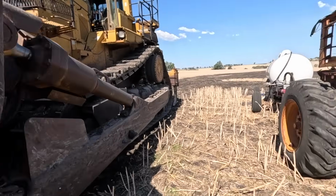So if you can't get the temperature down enough, or if the pressure is too high on your high side, then it struggles to liquefy the gas and it just doesn't work very well at all. So that's basically what's happened there. Hopefully we can get that sorted. I'm not sure where the leak is. I'll probably at some point put a dye shot in it, so we can help find the leak and go from there. But at the minute, we're off to the dozer to see what we find there. Back again.